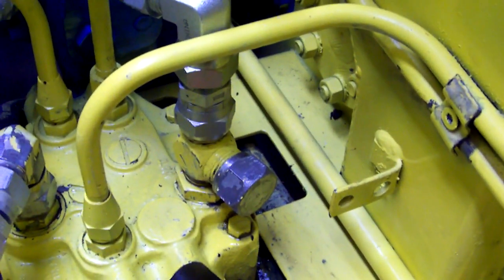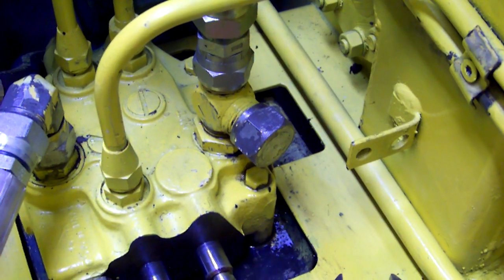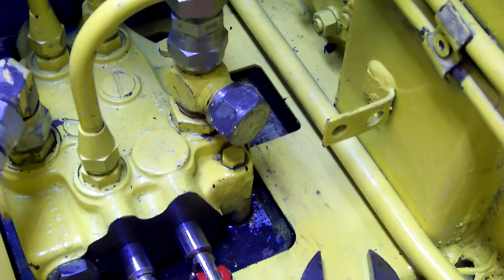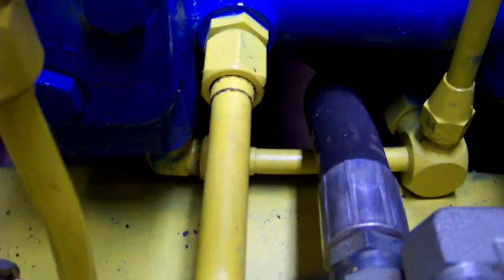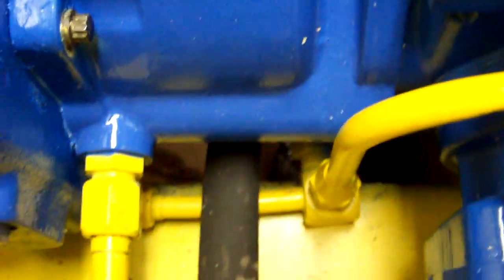You loosen that port and put a bag or bucket around it — when you loosen it a little bit of fluid will come out, but not too much. I used a bag because there's not a lot of room down there, and I zip-tied it on. You're also going to disconnect the charge line to the transmissions, which connects right back there. This is the drain line; the charge is the hose marked M — the low-pressure hose that runs from the oil cooler to the junction that splits with charge going to the right transmission and the rest going to the left side.